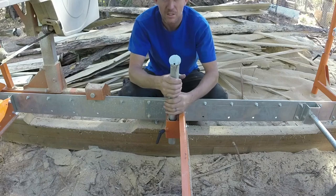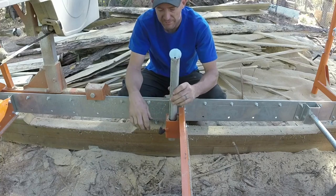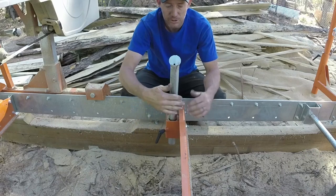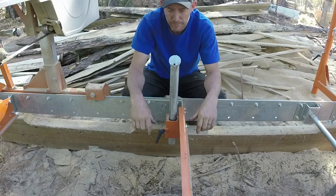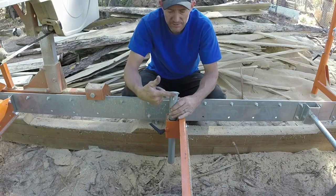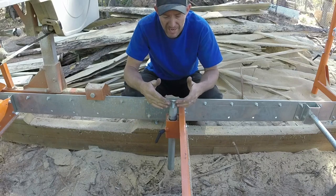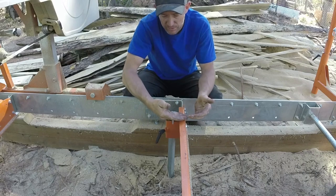The machine has two log stops — a nice stout piece of bar with a quick release that takes about a half turn. You can adjust the height and there are two set screws in the back to adjust the pivot so it's exactly perpendicular to the bottom. When you go to square up your log and rest it against here, it's going to be perfectly perpendicular. After you've squared it up, there's a secondary stop that's just enough to catch that squared log without getting in the way of the blade, and not too short that your log pops up over it. I haven't had a log pop up over this yet.